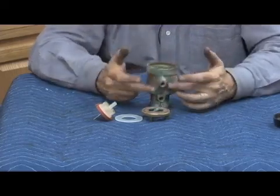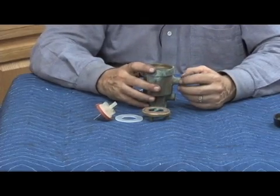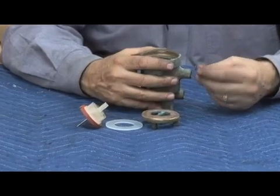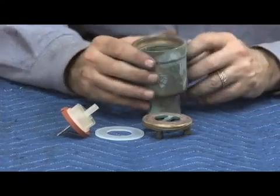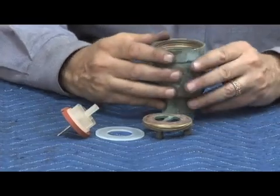At this point, note the test cocks. Test cocks utilized in the 720 have been two basic types: either the standard test cock with the screwdriver slot, or the older ones with a large boss — these had a quarter-turn needle valve that required you to rotate it a full half turn before releasing any water for proper test procedures. So you could have the old needle valve type or the current test cock type, depending on which version you have.